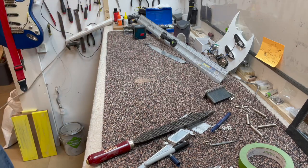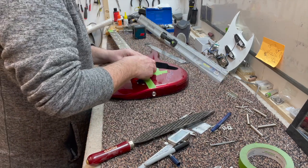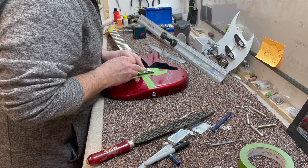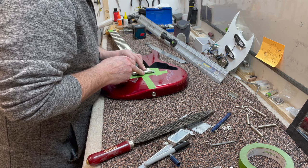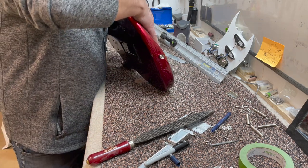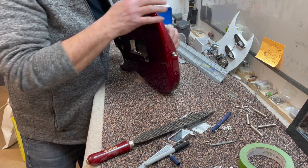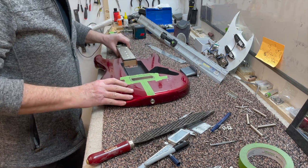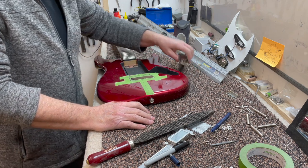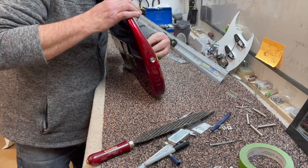Looks very slightly off, primarily because it was lined up wrong with the center line, but heck, that's nothing new there. Right, we're back in position. That's where we want to be. Now, actually, there's still no way this is going to work as a tremolo, even at the tightest squeeze. The only way it would work as a tremolo at this point is if we'd have to cut out some more material here. It'd have to be a route down from this top section, cut in quite a distance, depending how far it actually moves. Let's see if we can simulate it a minute.